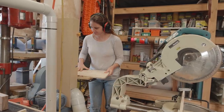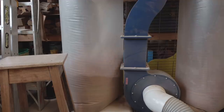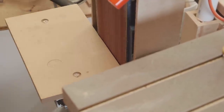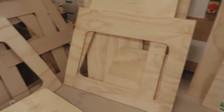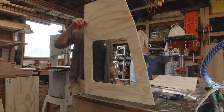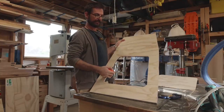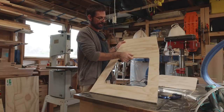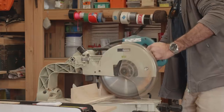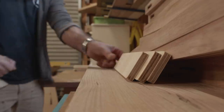Once Troy had made the cuts, I cleaned things up using the belt sander. A really great refinement was that Lance had connected a dust extractor to all of his machines. With the cuts all done, we cut some strips that are 60 millimeters wide by 300 long. We cut the supporting strips on the table and drop saws and then rounded over the edges on the router table.